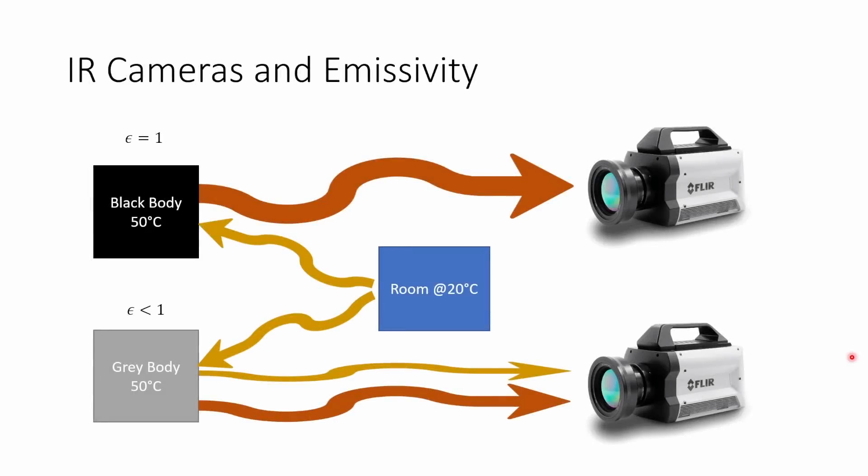In this video we're going to be using an infrared camera to image the air unit as it heats up. Whenever you're using an infrared camera to measure the temperature of an object you have to be very aware of a property called emissivity and the reflected temperature of the room that you're in. An object has this property called emissivity — it's a measure of how reflective that object is to infrared radiation. Let's start by thinking about a perfect black body. This is an object that doesn't reflect any infrared radiation at all, so when you image a black body with a thermal camera all you're seeing is the infrared radiation that that body is emitting itself. By looking at the intensity and the wavelength of that infrared light you can determine very accurately the temperature of that black body.